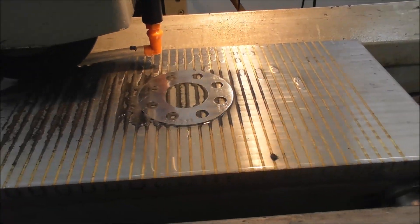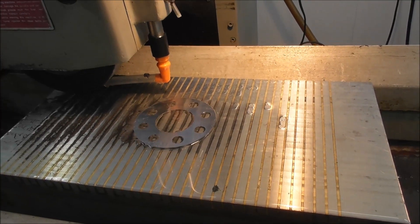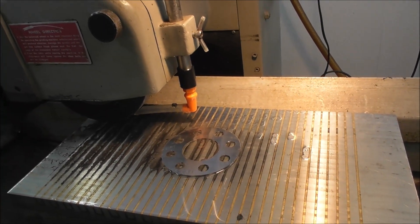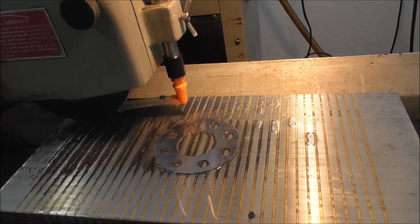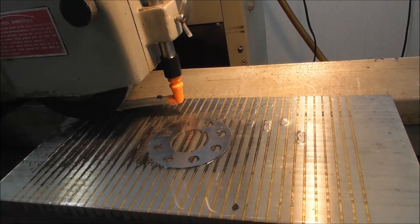I've always been really happy with this manual type of surface grinder. It's really excellent for this type of work because of the permanent magnet chuck — grinding parallel to the surface that is cleaned up by grinding the permanent magnet chuck — and then the top surface is exactly parallel to that. You're generating an accurate parallel surface.